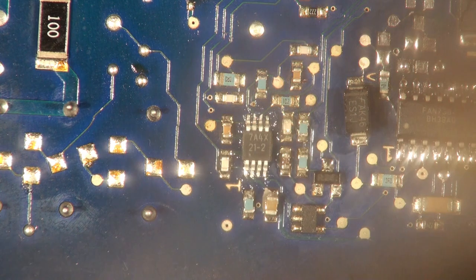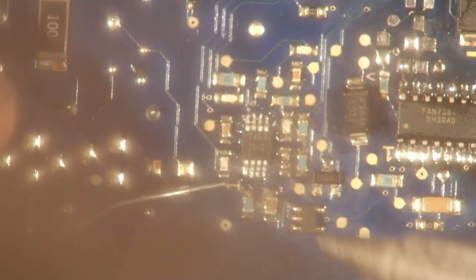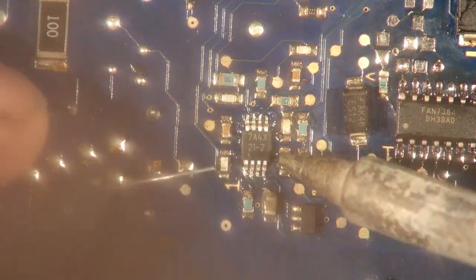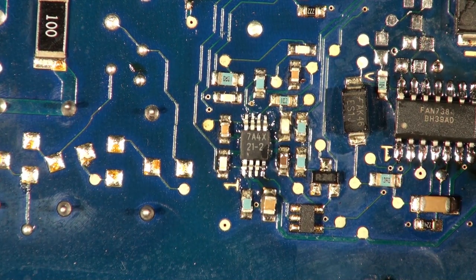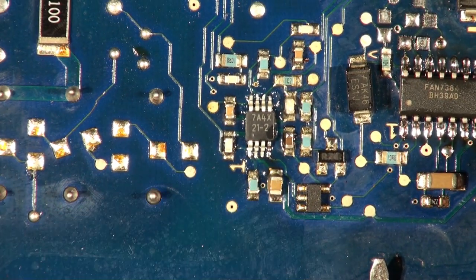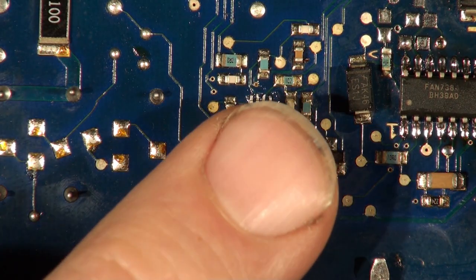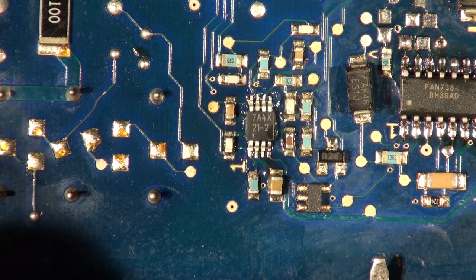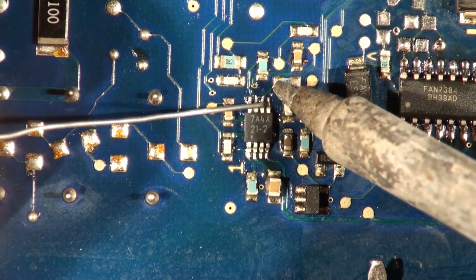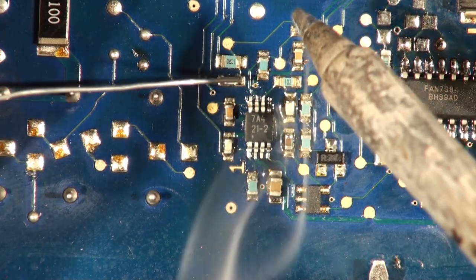Normally I'd use a hot air gun for this — I'm doing the manual method for you guys. There's a bit of solder — first pin soldered with a fairly blunt tip. Did you see that? The pin on the corner is now soldered. The chip is in position. Just to give you the scale — there's my finger, and there's the 0.5mm solder wire. So we're talking fine pitch, and it can be done, but will I be able to do it? Let's anchor the thing down properly.